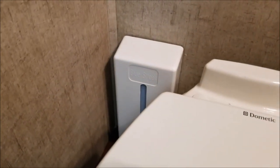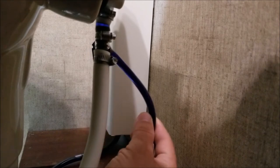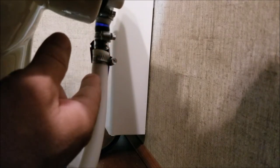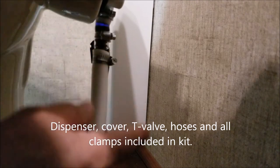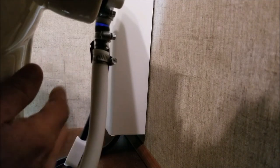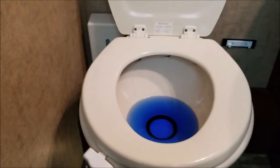Now we're looking behind the toilet. This is the side of the reservoir, and there's a clear tube that comes from it going into this t-valve. The valve is cut right into the incoming line that feeds your toilet with fresh water. As fresh water flows through, it pulls a certain amount of liquid from the reservoir. The install is simple: you cut the tube, insert the t-valve, put two clamps on it, connect the hose from the reservoir, and you're done. It only pulls a certain amount of fluid through its design.